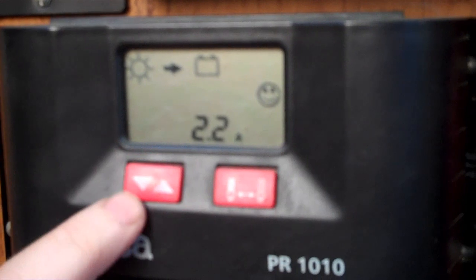That is exactly what's going into the batteries — there's a little bit of drop, but only a tiny amount. That's how much is physically going out at the moment, which is nothing. And this is how many amps we've actually generated with the panels today. I zeroed this setting at about 11 o'clock last night, so so far today we've had 25 amp hours.